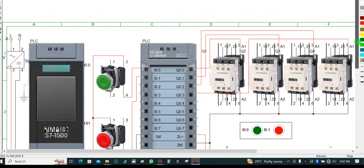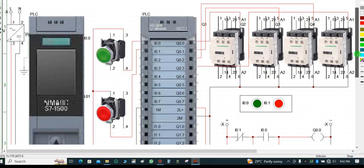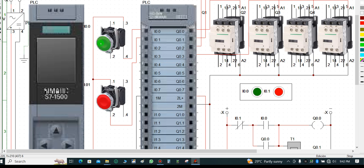This is my start push button and this is my stop push button. The start button is normally open — a spring-loaded momentary push button. The hardware switch on default setting: NO is green, NC is red; the NO contact is open and the NC contact is closed.